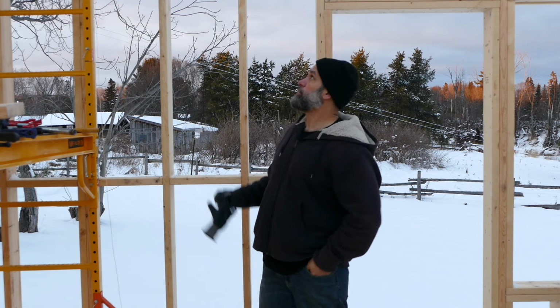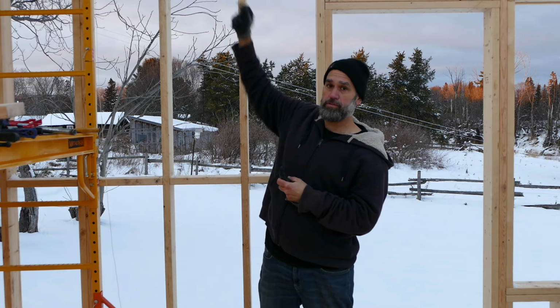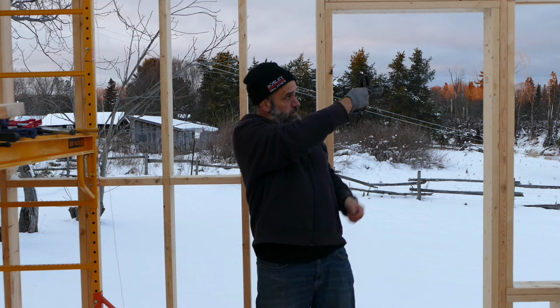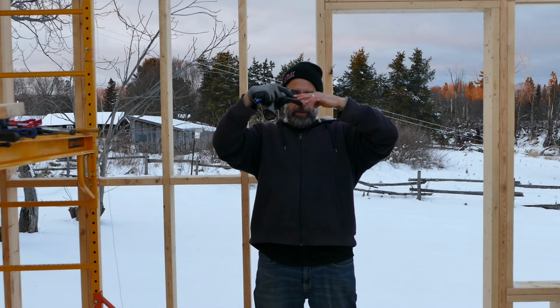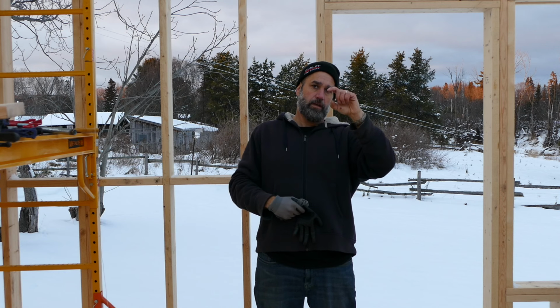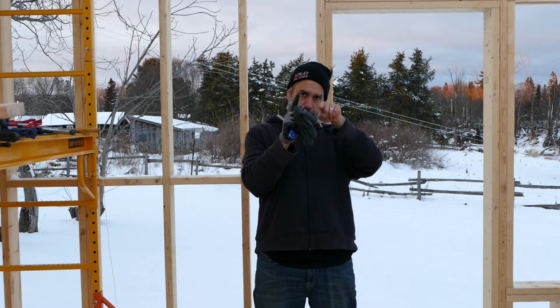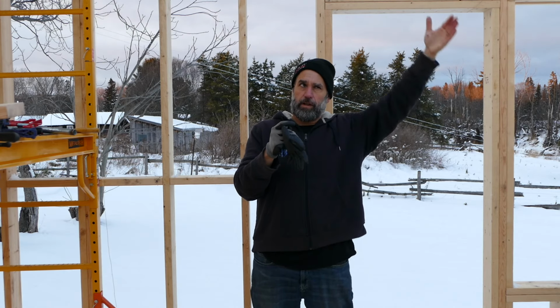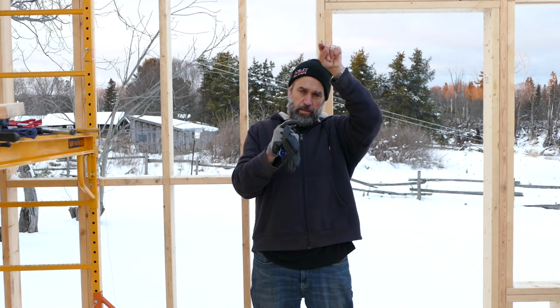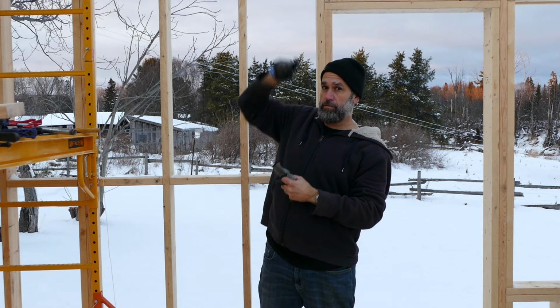I have these little nail brackets, and what I'm doing is I went up to the bottom edge of my ridge beam, and I tapped that in right beside the post, which is analogous to the edge of the plate here. And then over on this side I've done the same thing. I used a pair of pliers and held it in place and then tapped it into the very top corner of the plate, because what I want my rafter to do is come down perfectly, hit that very perfect edge of the plate, and then I'll cut my bird's mouth, parallel to the plate, and then the seat cut down the side, or the plumb cut. The plumb cut I think is the tail cut, so the seat cut is across the top, and then the plumb cut down the side. And then what I'm going to do with that string, I'm going to tie to the bracket at the top corner.